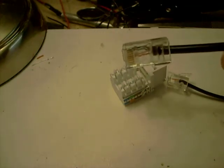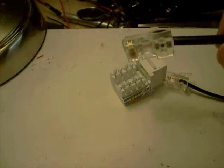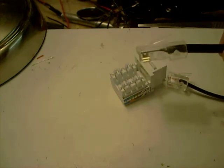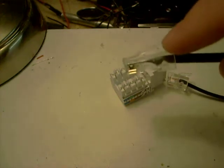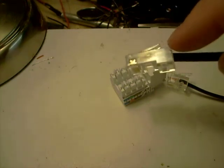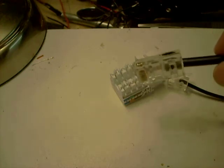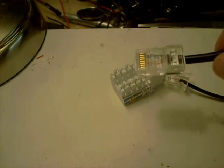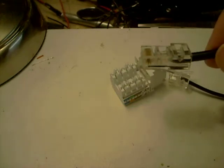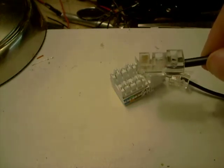We did try some more exotic solutions such as screw-in connectors and things like that, mic connectors, and don't get me wrong, they work beautifully and they're extremely strong and they can handle quite a bit. But your average individual who wants to be able to, let's say, replace this end connector if something does become damaged, or wants to put it together themselves, needs to be able to have something that's readily available. They don't have to go hunting for it. They don't need a soldering iron. They don't need these special tools, except for maybe a Cat5 crimper, which is easily available anywhere on the planet nowadays. We just saw this as a much better solution.